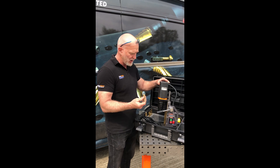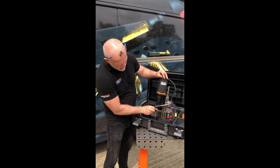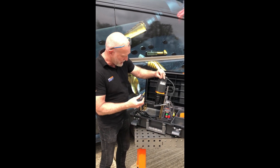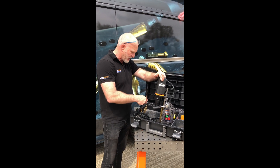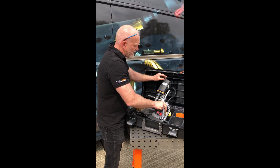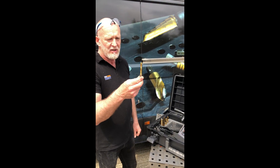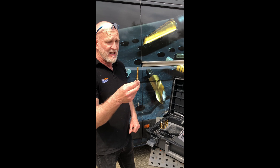This is why these tools are all part of the kit — you can put things like the step cutter in, and you have enough stroke on the machine to do what you have to do. In the Agri starter kit you have — just laying this down for you — cobalt drill bits from 8 to 12 millimeter, 8% cobalt, which is very good for stainless steel as well.